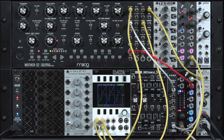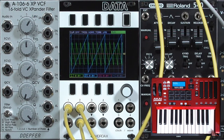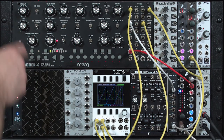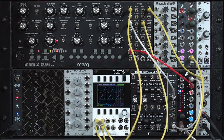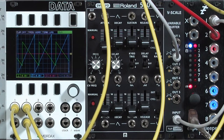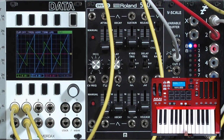That's pretty close to in tune. Now when I play an octave down, there's still some movement. When I play an octave up, there's movement in the opposite direction. If I go up an octave, there's quite a bit of detune between the two oscillators. So the last time I trimmed it I got fairly close, but we can do even better. I'm going to move my voltage output down to output number two on the V-Scale. It ships from the factory with all outputs at perfect one-volt-per-octave tracking, but I've been playing with this module and this output may be out of tune — middle C is in tune, but one octave up is quite out, and one octave down is very much in the other direction.